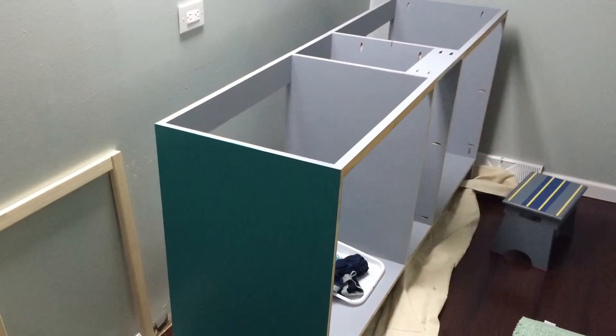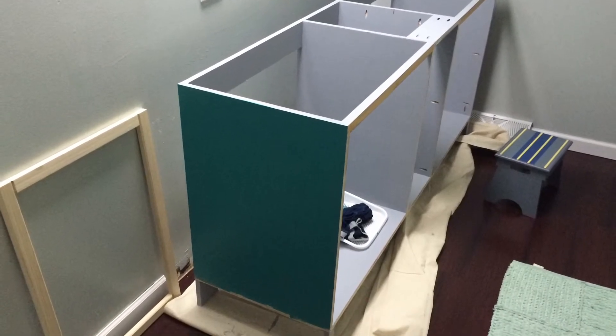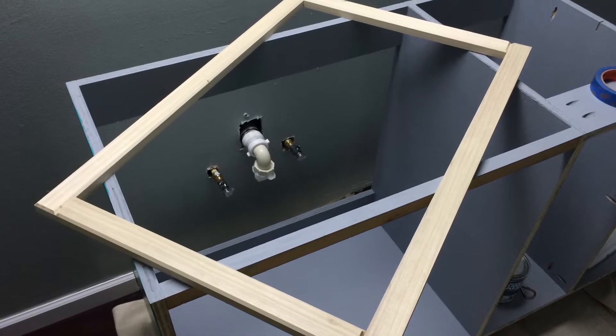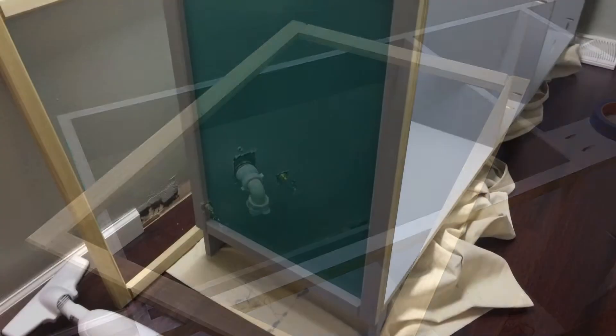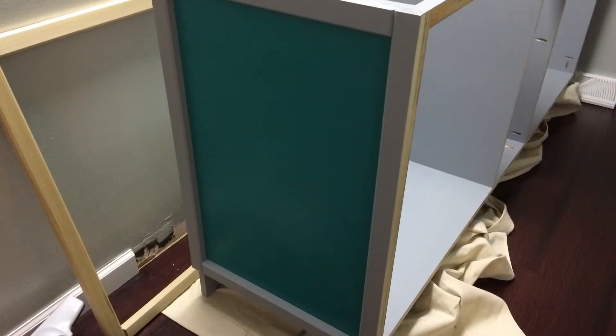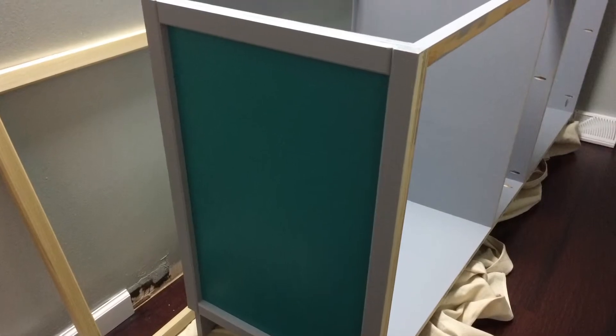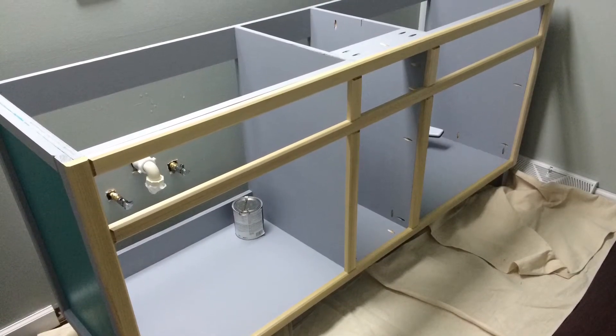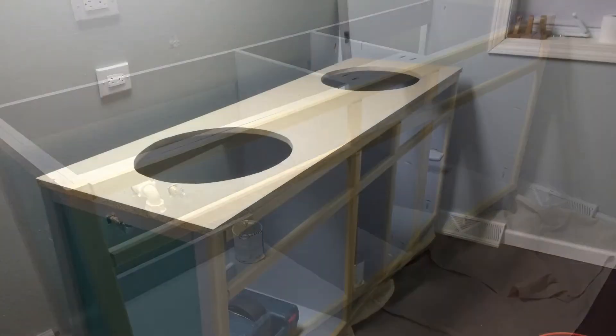This is the basic frame. I built it upstairs after cutting all the pieces in my garage, putting it together out in the hallway and then sliding it into the bathroom, because it would have been too big once everything was together. There's a piece of the face frame — one rectangle — that I put on the side, and I did a little test paint on the side, but that teal was too much. Here's the front face frame, all put together with Kreg pocket screws.